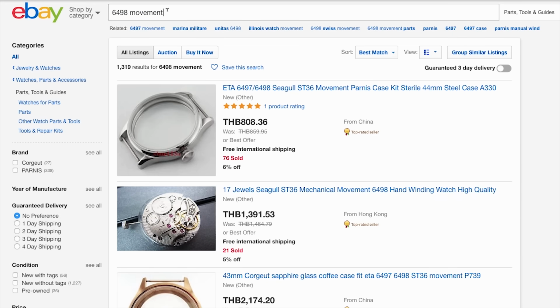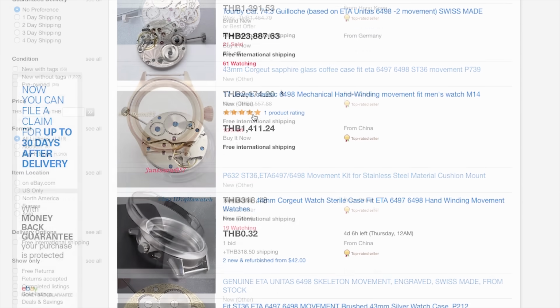If anybody has been following my channel or my watch repair course, you'll know that we've been working with a clone of the ETA 6497, or in particular the 6498 movement, throughout the course and throughout some of my recent videos. And of course I have a few of these lying around, and so we're going to base this project on the ETA. Well, this is an ETA 6498, and so the off-center seconds hand is at this position, and so we're going to need to buy a dial for the ETA 6498, and this is a clone of that movement, a Seagull ST3621.